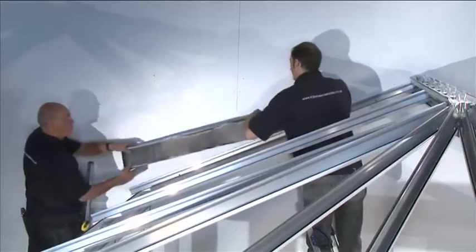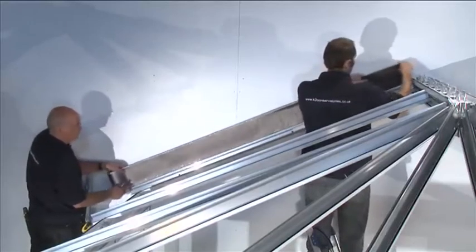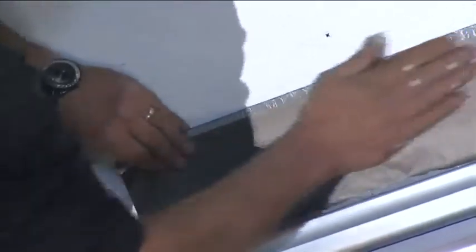Primary seal to host wall. Self-adhesive flashing tape is included in your conservatory kit. The tape is provided as a means of temporarily sealing the conservatory from water ingress. Cut the flashing tape and apply the flashing tape to the host wall. The flashing tape should run down 3 courses of brick and run into the drainage channel.